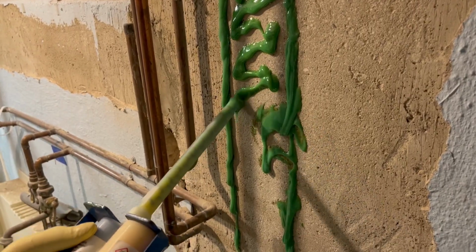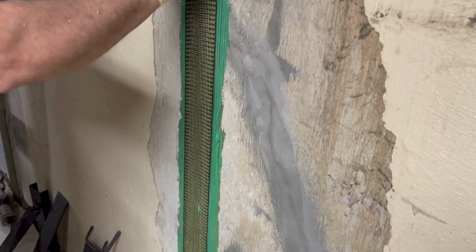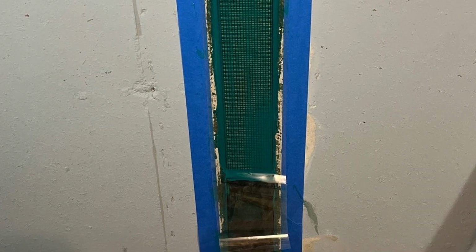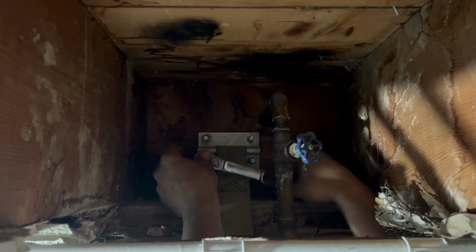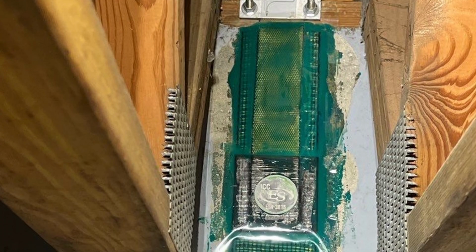Then the carbon fiber is applied onto the wall with epoxy, which soaks the carbon fiber and attaches it to that foundation wall. Now most carbon fibers will typically have two anchor points apart from their bond with the wall. The first will be the top anchor. This particular anchor will hook behind the sill plate, which is that back board that goes behind your joists. It can also hook onto the joist itself, and there's even a connection that hooks it straight onto the sill plate. And that'll help connect the carbon fiber to the top portion of your wall and subfloor, which helps hold everything together.